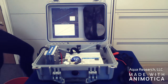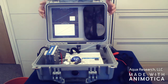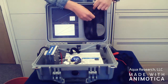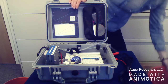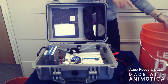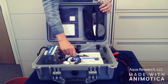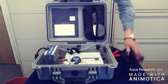Your stream produces disinfectant solution by pumping salt water to the electrolytic cell with a small pump. The brine solution is drawn from a separate brine tank such as a five gallon bucket. The oxidant solution flows from the cell into another holding tank or into the raw water. The system can function on electrical power obtained from a commercial source, a generator, a solar panel, or a car battery with the provided jumper cables.